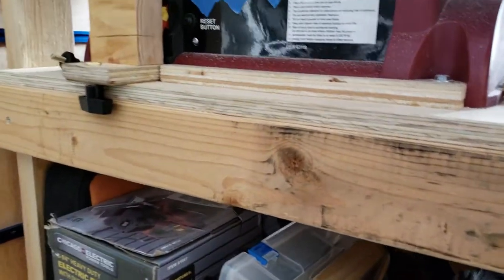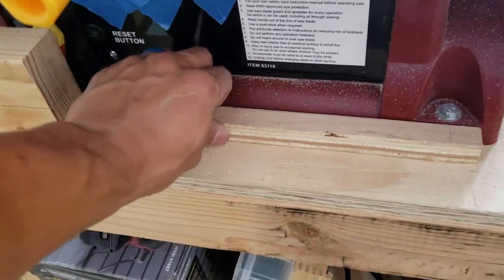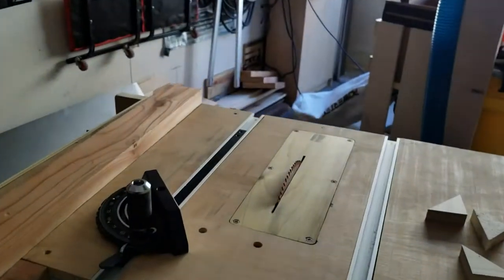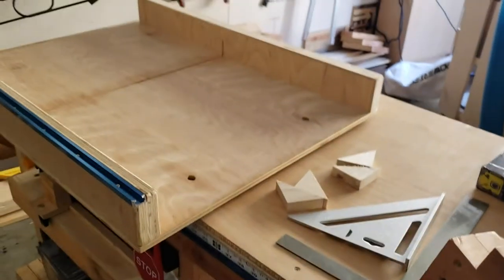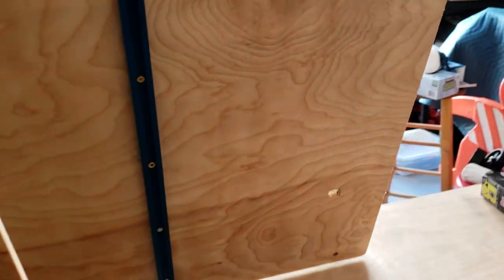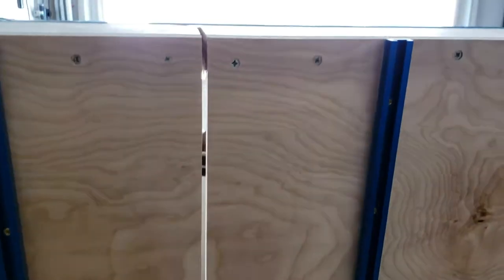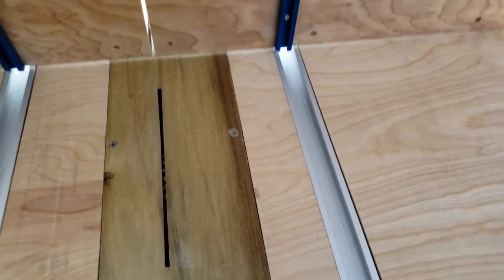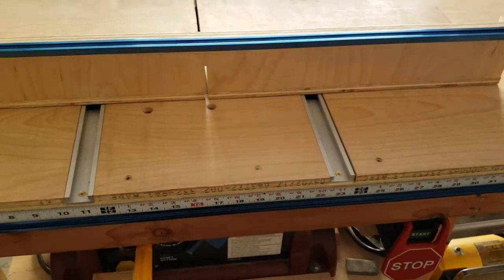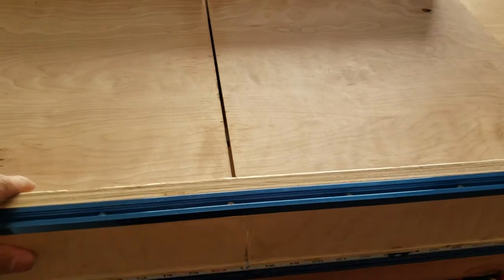I used leftover plywood for the shelves. I did reinforce the table saw and keep it in place with extra scrap — it is bolted in, but just in case. Here's my crosscut sled — I love this thing. Do spend some time making it as accurate as you can. On the bottom I have some upside-down t-track that fits into the tabletop rails, and it gives really smooth action. This is why you want your guides parallel to your blade — so whatever you're sliding through is smooth and you get a straight cut.